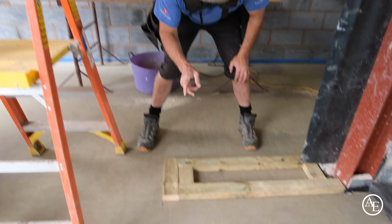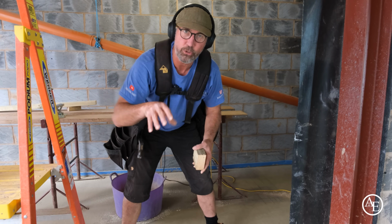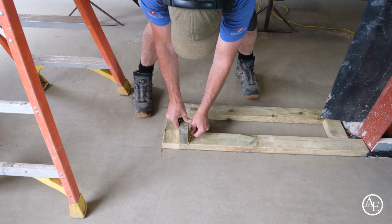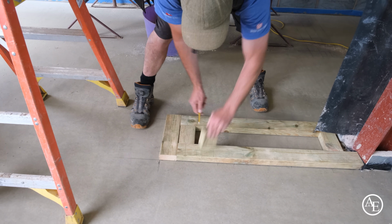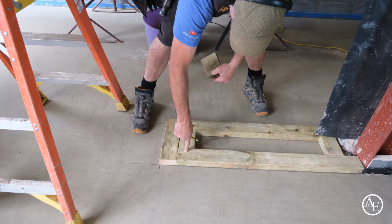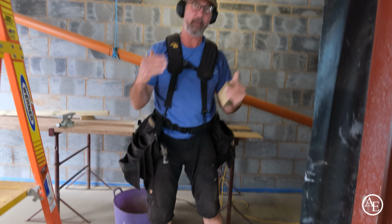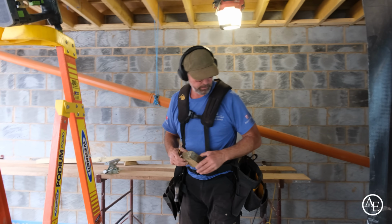Now, one thing I have done, just to give you an idea what I'm doing, I've got to put a bookcase in here, so I've got to think about how I'm going to fix the bookcase to the stud work. So I'm going to go here, that'll give me a good fixing in the side here, but then I'm also going to put a timber here, because then the other timbers where the bookcase pushes to is going to be the other way around like that. So that means when I push this bookcase to the back here, I can actually get a fixing in there, but then also I can get a fixing in here. So that means I've got 1, 2, 3 points of contact of fixing, also one in the middle if I want one, but it's just making sure the sides are really well secured because of the amount of load that's going to go onto it, because they're going to stack this full of books. This area is going to be a bit of a snug and a reading area. So right, let's crack on.